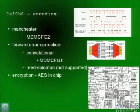The Manchester encoding is actually a very powerful one that says that between any two bits, be they one or zero, in the time frame of any bit, there will be a transition. So if you have a zero, the transition will follow each spec, and as you can tell, there are a couple different specs listed up there.